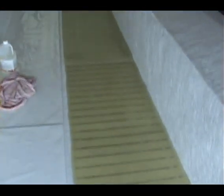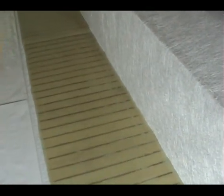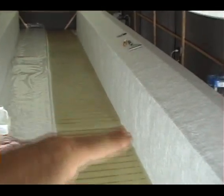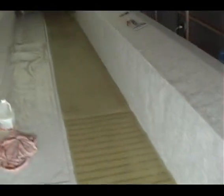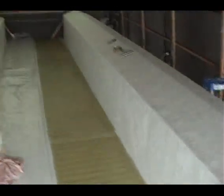That took about four hours — batch by batch, pouring about 70 ounces of resin and working one section at a time. I had about five or six batches of 70 ounces to impregnate the two layers of cloth for half the section. I can walk on it now and it is very, very strong — there is no flex, nothing. This hull will be very strong once all of that is done.